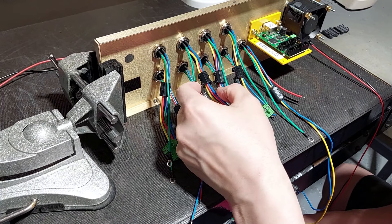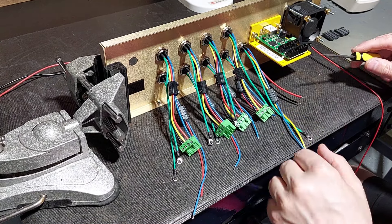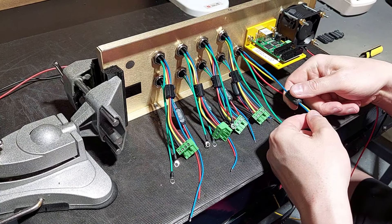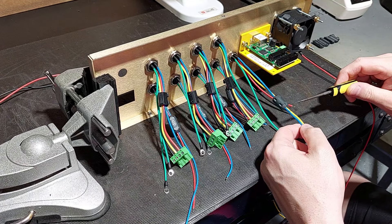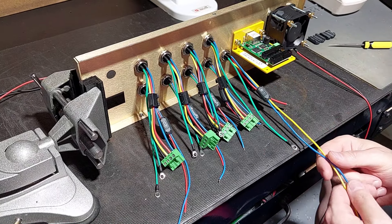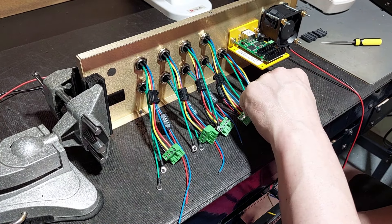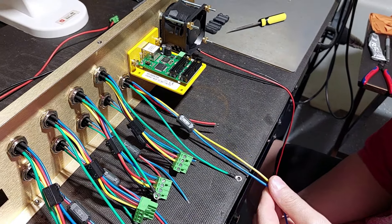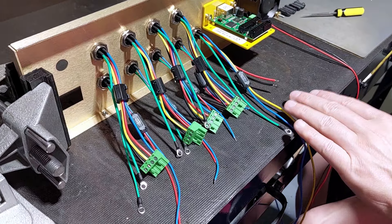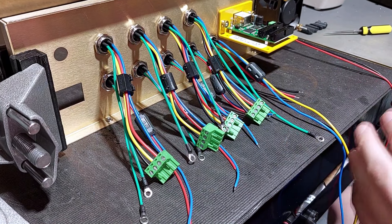All of the sizes and frequencies are matched — that's why you see different sizes being used. On our VFD it's the same principle. These are 18-gauge leads and you can see how easy it is to adjust; I did not need heat shrink here. I'm going to cover why only two leads are being filtered: because those signals are not requiring filtering. You only want to use ferrites or shielded cable on any lead carrying a sensitive signal.